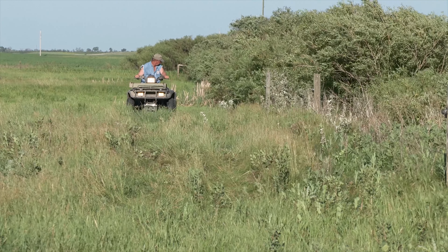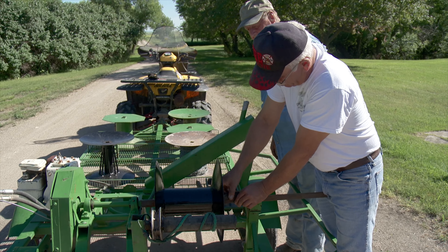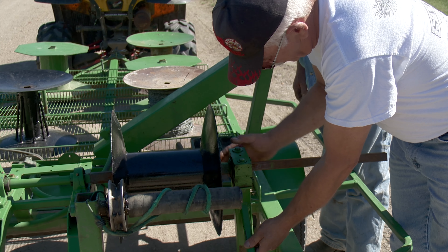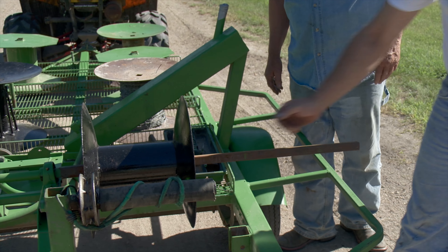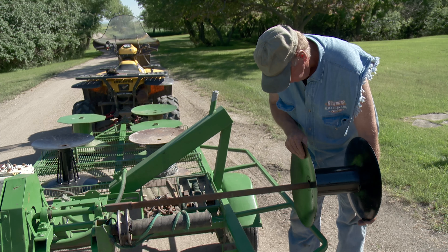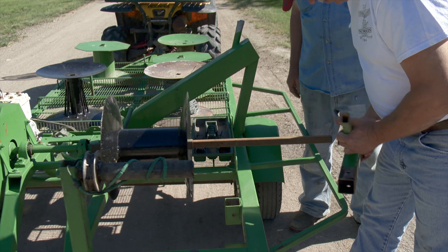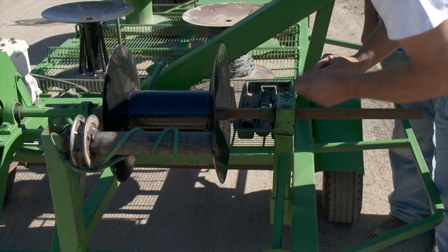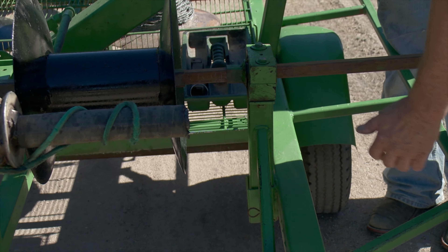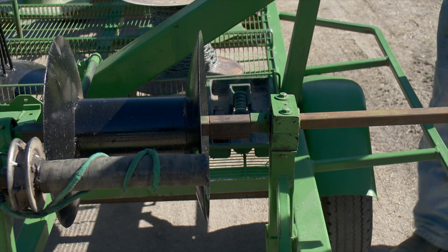Changing spools can be a difficult and time-consuming job, so Dickey and Manshreck came up with a design that makes it relatively simple. We have a spacer here that is removable. We have to take that off because of the weight of a full spool — we need a bearing support at the other end. And it comes off like so. Then the spool comes off — it's that simple. Put a new spool on, add the spacer, and there's a pin that goes through here to keep everything aligned so the spool always stays lined up with the threader.